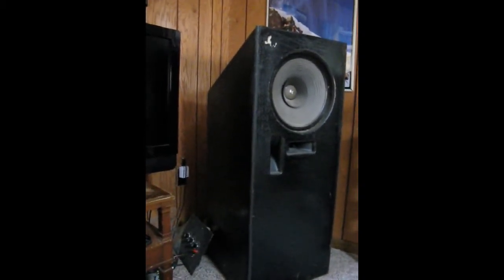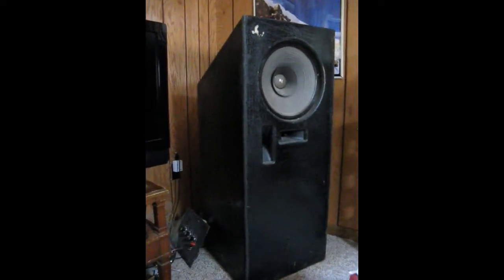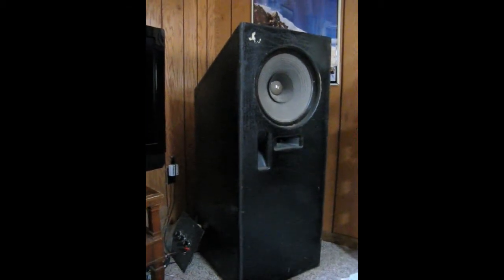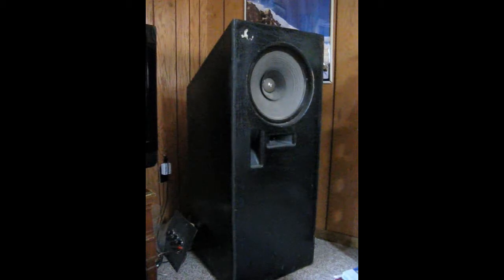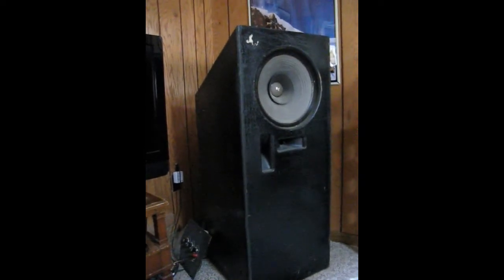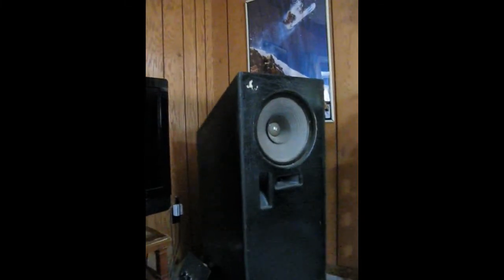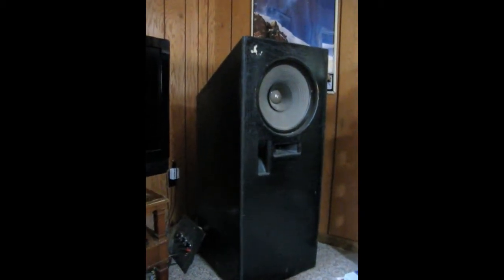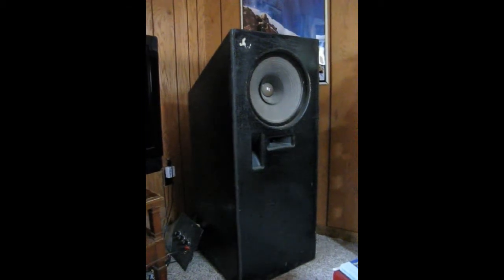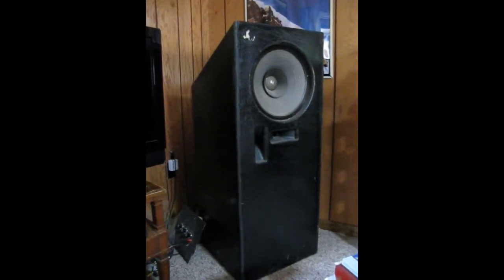The idea of this cabinet was mostly for sound reinforcement rather than Hi-Fi, although working in a corner it should still work pretty well — and it does. They don't quite get the super low bass that the 70s version did; the loop length is a little bit shorter. I was actually going to make the loop length longer because these were intended to be stacked — picture an array of 6 or 8 of these laying on their sides in a Chevron formation, stacked 6 or 8 high. That's how I was intending these to be used for sound reinforcement, which would have lengthened the effective loop length. But I never built that many — those two partners I worked for went in different ways.